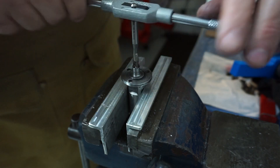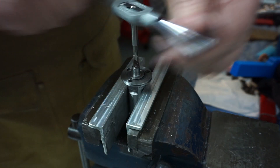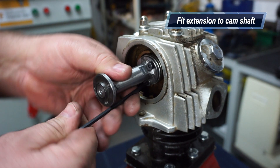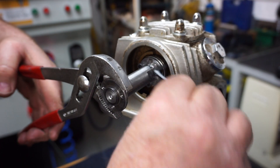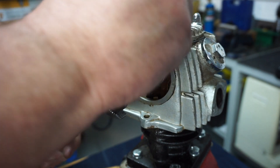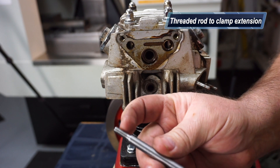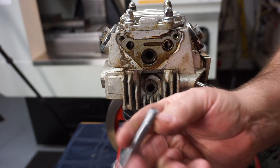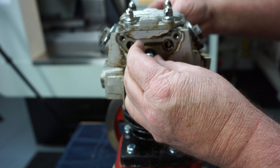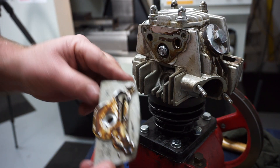This will be self-explanatory later on. I had to make a retaining stud that screws inside the shaft and bolts up to pull that shaft in. The retaining stud has M6 on one side and M8 on the other - you screw it in and bolt it on, which pulls the spigot tight into the existing camshaft and helps with its concentricity. You can see here bolting it up with three bolts, holding it with a pair of multi-grips while tightening.